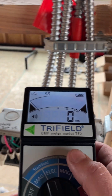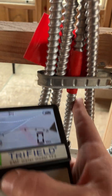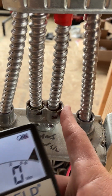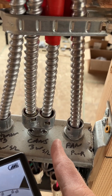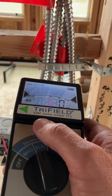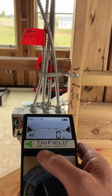So it's really important — in order to make this work, you have to have your ground. These cables have to be grounded; the sheathing has to be grounded. So it's really important to get good connectors to make that connection. You have to have metal boxes in order to do this. Otherwise, it will work just like Romex. If I had Romex in this wall, I could be three feet away and still be getting a reading that's over what I want.